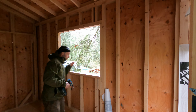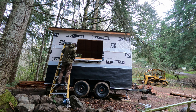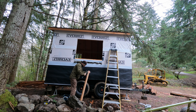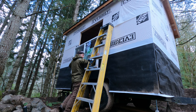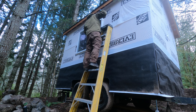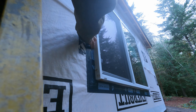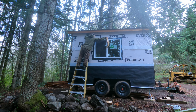I completely screwed up and didn't see the note I had that I had to cut this wall down and just kept building on the cabin. So right now I'm removing that two-by-three sill board and ripping down the siding. What happened originally was I framed the window and forgot to accommodate for that lower sill board, so I just had to cut it down another inch and a half. It was a little bit of a step back, but putting everything together with screws made it pretty easy to take back apart again. And look — I got the big window in. I still have one small sailboat port light window to install up in the loft section for ventilation, but that's going to be really simple.